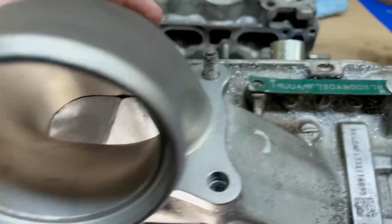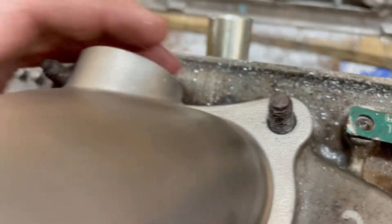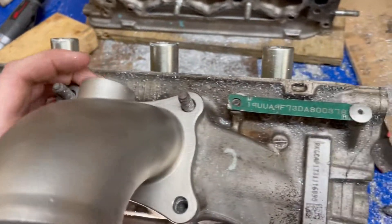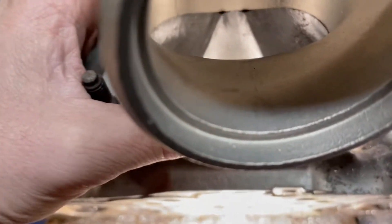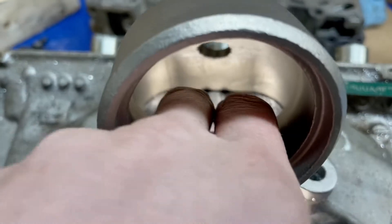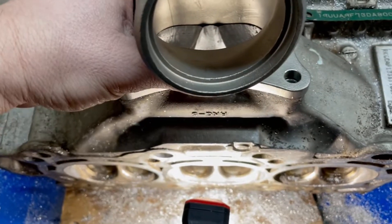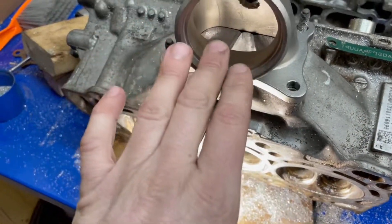I'm going to put a little tack in here and then basically take a little tack or grind it down so the port is as high as it can go. When I put it on this port it's going to be in the same position - right now it's got a little more play than I like. You can see it goes up and down in the port. If I raise it up all the way there's a lip on the bottom side - I can't get the camera there but there's a small lip I can feel. So I'll tack it, raise the PCD up, and bore this out as well.